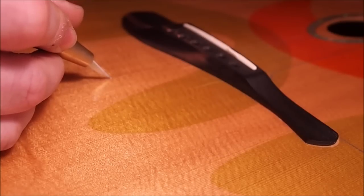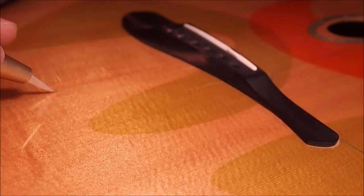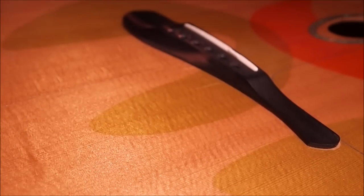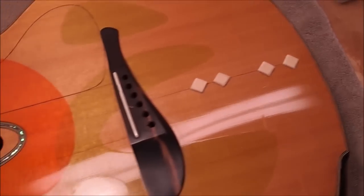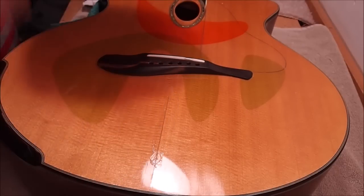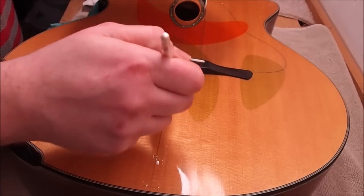There we go — it looks pretty clean. Before the glue-up, I made some spruce cleats to span the crack. In the end it didn't need all of these, but the extras won't go bad and I'll use them on another job. I decided to go with fish glue this time — I wanted a protein-based glue. Titebond and other aliphatics tend not to stick to themselves all that well.